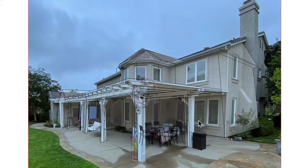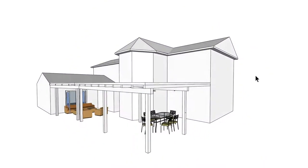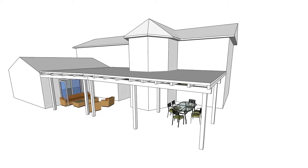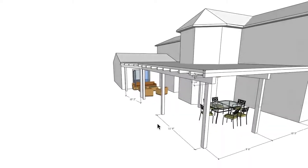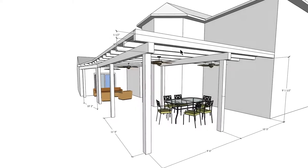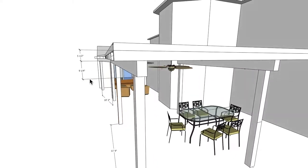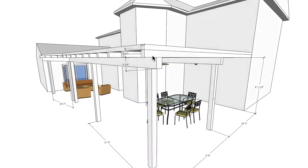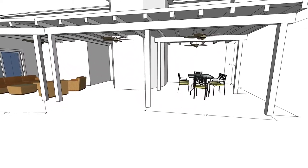Alright, so here we have this residential application. The customer had mentioned that they're looking at heating up two areas — one back here and then one over here. Let's go right into the drawing. We have a span here of 10'9", a height of 9'1½" to the lower end of this beam here. And then we've got these two measurements up here: 5½" and 9¼" inch beams. And then we have some fans located in the central section of the spaces here.